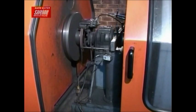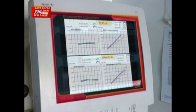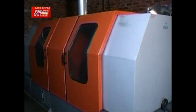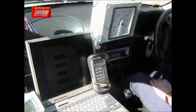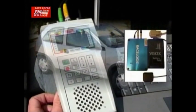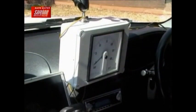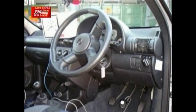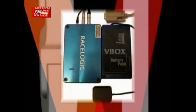SafeLine uses ECE90, which has two of its own dynamometer testing machines, utilized to conduct wear test comparisons, thermal analysis, fade tests, speed sensitivity, and cold performance equivalence tests. In addition, on-car testing is conducted on various vehicles on a regular basis. The most recent report was done by ECE90 utilizing an Opel Corsa light. Rear brakes are disconnected, and the V-box, which works off satellite navigation, is connected by sensor to the front disc brakes. An inline pedal pressure gauge is then connected to the brake pedal. At a predetermined speed and predetermined brake pressure, on application of the brakes, the information from the V-box is sent to the computer, giving the exact stopping distance reading.